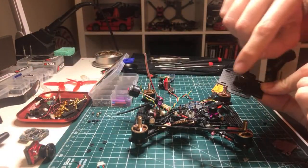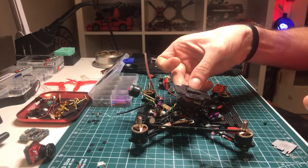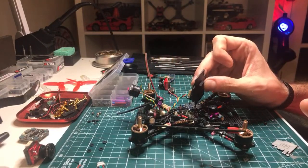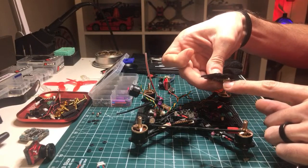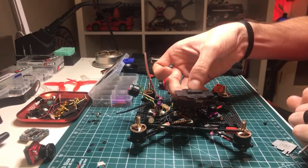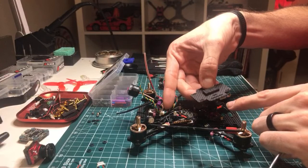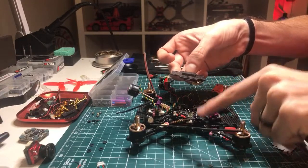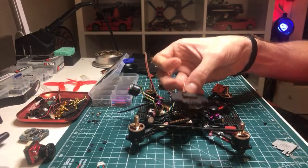So Tommy put these slots here in the battery tray so that you can mount your... initially, he was thinking mount the entire stack to the clean plate, which is a huge pain because you've got all your motor wires coming to the ESC. What I realized when he sent me the Proto way long ago is that if I just ran a little bit longer of a breakout cable, or whatever the hell they're called, patch cable, I guess, from the flight controller to the ESC, I could just put the flight controller up on the clean plate and then have the, you know, of course, the VTX and the receiver and the cameras all wired to that, which was fine. Those are just little, very bendy 30 gauge wires. And then just have that cable running down to the ESC, which has all the thicker motor wires on it. So that would really give the flight controller the most possible amount of movement.